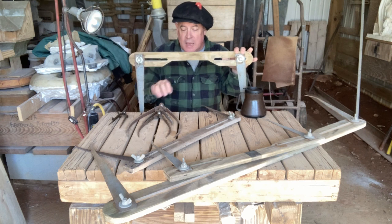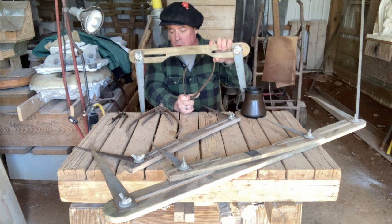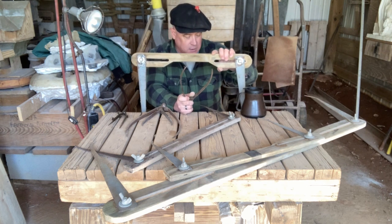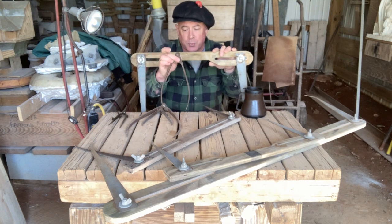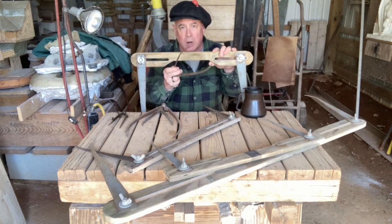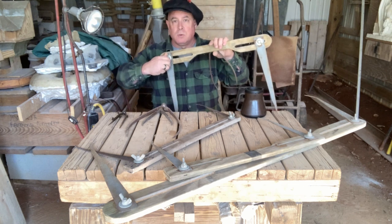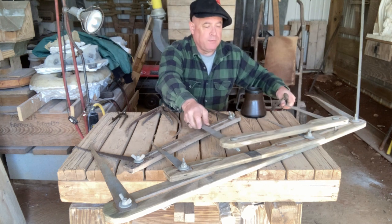Make several of them — make a couple of sets. For every point that you take and shoot, you're going to need one compass to capture it and one to translate and apply. Because you have to keep your old one set to the original measurement just in case you bump your tool. If I keep my original compass set to the measurement I took, until I'm done producing that new point, I can still go apply it to my triangle again. If I'm doing three radii, I need six compasses to use every time I shoot a point.